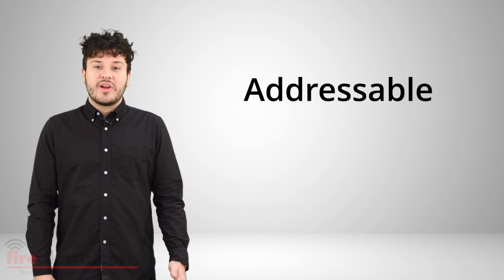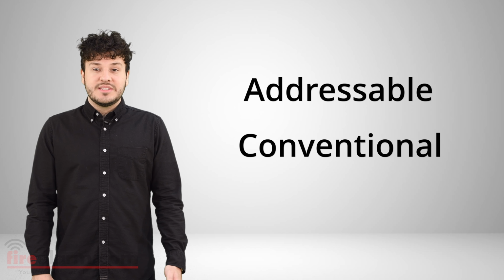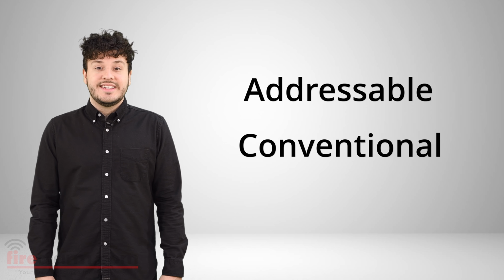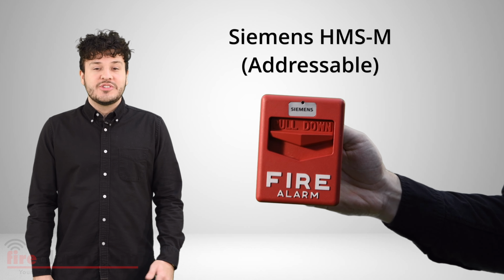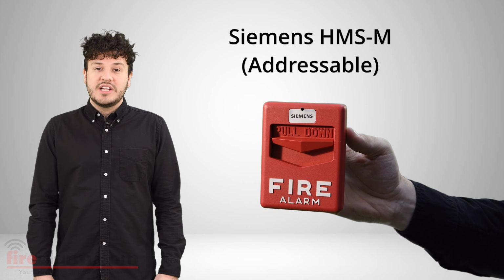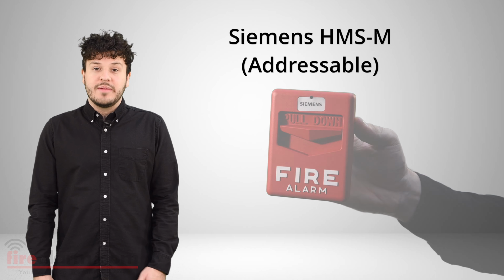Just as with any manual station, make sure you return to your fire alarm control panel, acknowledge the trouble or alarm caused by you activating the device, and reset your system. Remember that manual stations can either be addressable or conventional. If they are addressable, there is usually a module built into the back box of the device. Any conventional station can also be made addressable onto a system, as long as a new addressable module is installed and programmed specifically for that manual station.